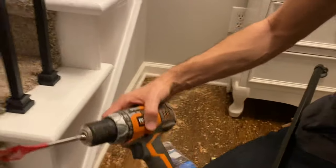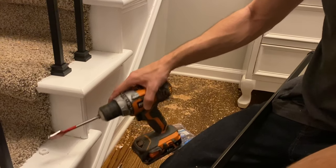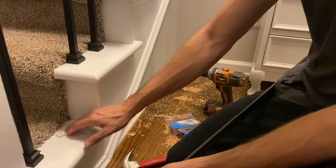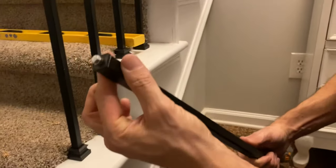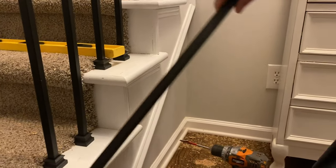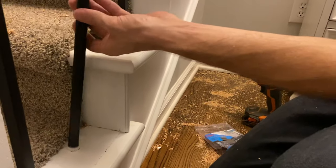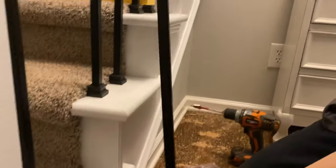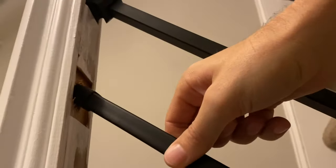I had to use a drill to hollow them out because our old balusters just sat on there — they were nailed in. So I drilled holes. It's easy to measure how wide you need it, then you tap these in. What this does is it taps into the actual baluster, which allows you to set it here, and as you turn it, it pulls out and allows the baluster to raise up into the top hole you've drilled to a tighter position.